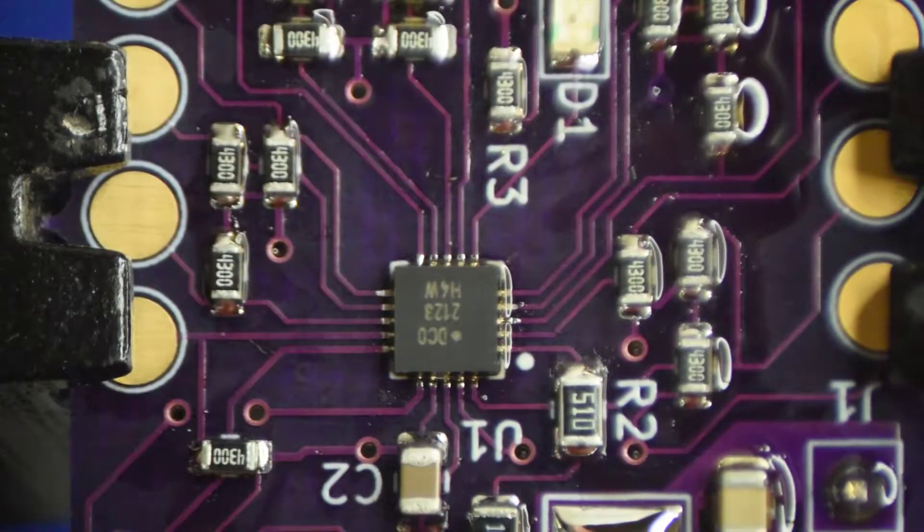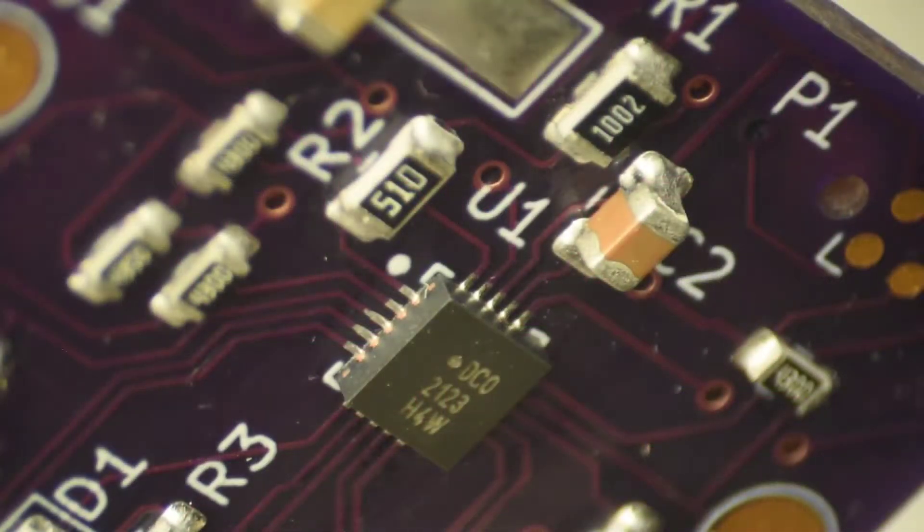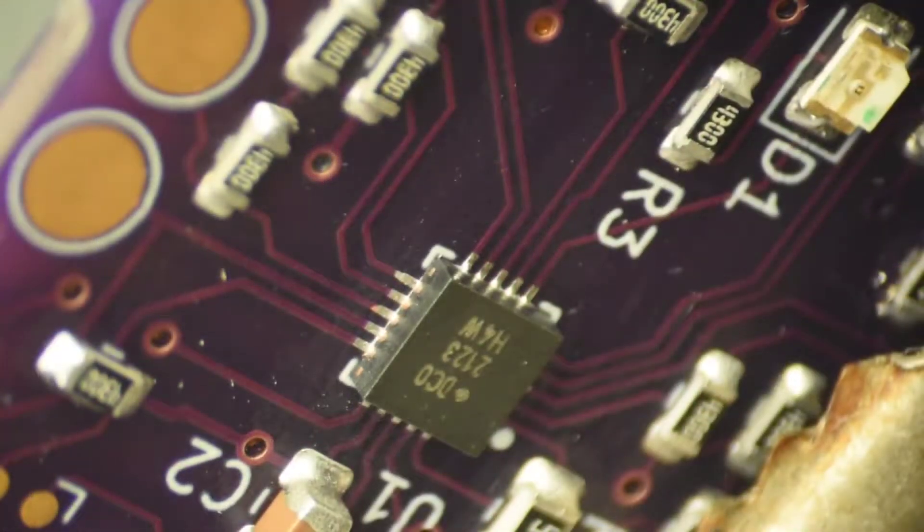Let me clean it off and see if I can get a better view of the connections. Those look good — a nice little solder fillet on each pad to pad joint, and a pretty consistent one. The other 10 pins also look quite good. I'm very happy with that.